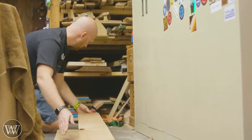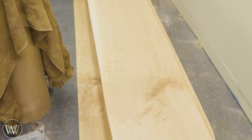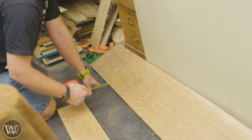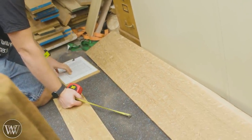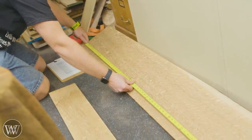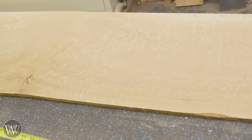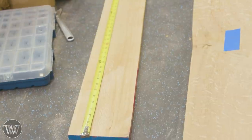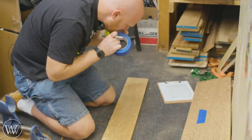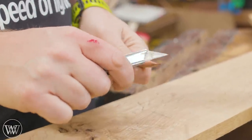This is kind of the fun part, especially when you're using reclaimed lumber — you're working around knots, cutting a little off either end, and imagining all these pieces coming together. I have this piece that's absolutely gorgeous, almost 13 inches wide in the middle, but I need a top that's 18 inches wide. So I need nine inches from the middle of it. I don't have a piece thick enough to re-saw and butterfly, and I want it to be a full three-quarters. The grain on this one goes at an angle, so if I match pieces together I can kind of make that seam line disappear. I was very happy to find out that I could actually get everything out of what I had in stock.